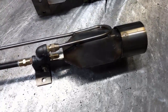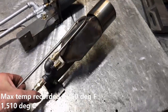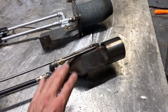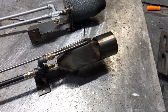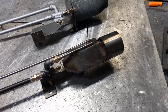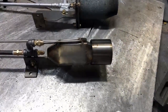This burner can get up to 2,530 degrees in about 6 minutes. And I'm talking a crucible of melted iron. I melted a crucible full of cast iron with this burner in 8 minutes from a cold start. This thing just gets so hot I can't measure it. I believe the top temperature I've ever got was like 2,600 degrees on this. But I melted steel one day — a steel cowling inside the crucible — which would indicate we actually hit 2,700 to 2,800 degrees, because that's the melting point of steel. Cast iron is 2,100 to 2,400.